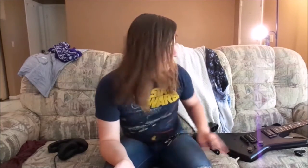Anyway, what I'm going to be doing is supplying a white noise that I've EQ'd to be fairly flat in frequency response to the pickups, and then I'm going to record the output using a DI. I'll do that with the stock screws, without any screws, and for each of those three other screws, so I can compare the frequency response. After I do that, I'll go ahead and put the strings back in place, retune it and all that, and then I'll probably jam out a little bit so you can hear if there's any intrinsic audio difference between using each of the pole pieces.